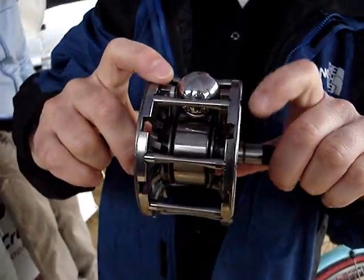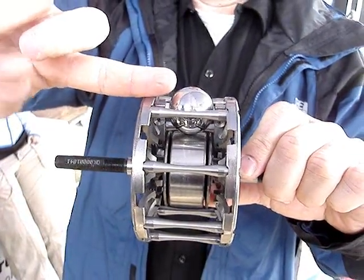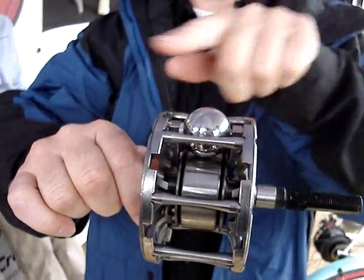Now the way we get the different ratios — there's an axle through the sphere, and right now the axle's level. So the input disk touches the sphere here, the output disk touches the sphere here. Both those distances are the same, so that's one-to-one through the mechanism.